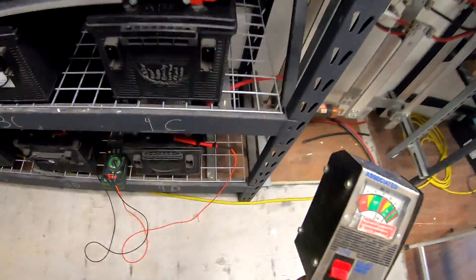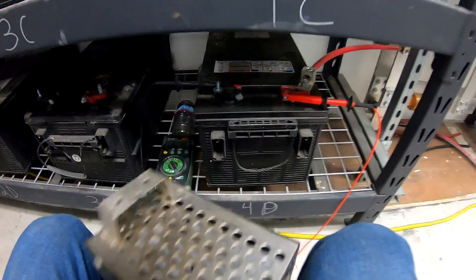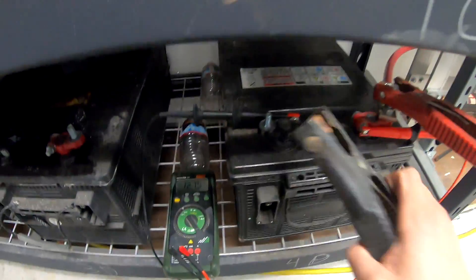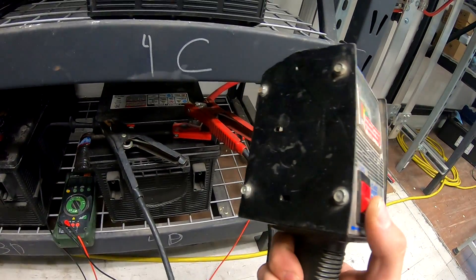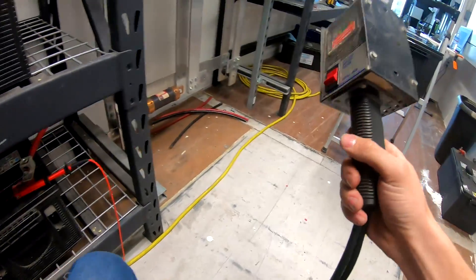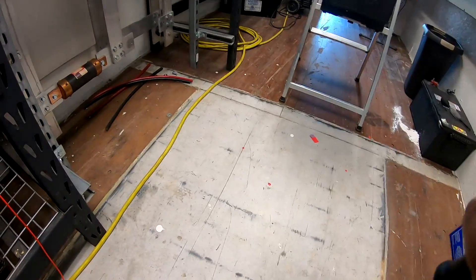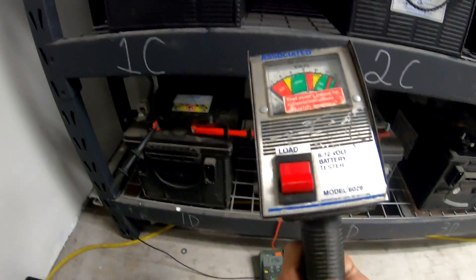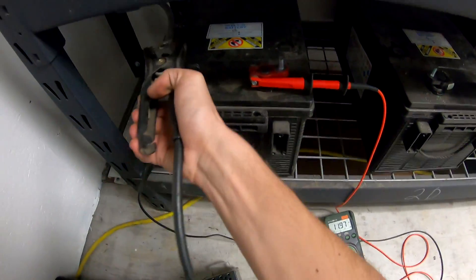Here I'm doing my testing process. This is the load tester — there's a heating element inside and I was clipping it onto the battery with my multimeter and clipping probes to load-check. But this switch burned out on me after about 16 batteries. It's about 30 years old, so I'm going to take it apart and make my own load tester. This battery right here is at 11.96 volts, and since the switch is no good I'll demonstrate the load test directly — watch the meter as I connect it.